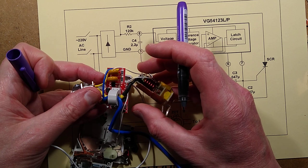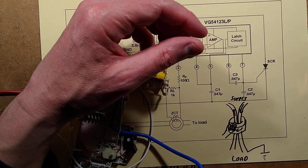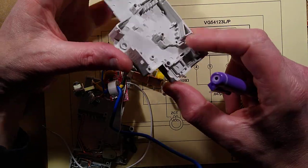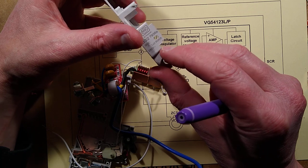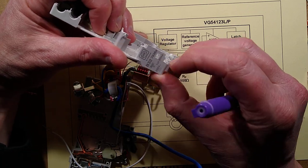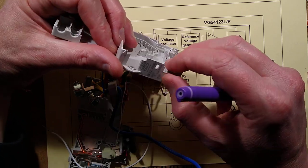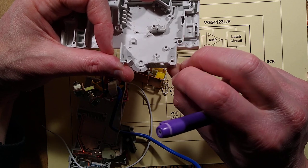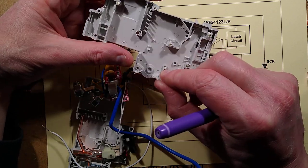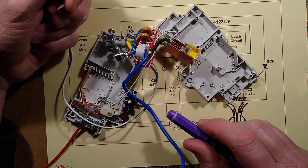But interesting little device. Oh, the reason it failed in the first place, the reason the button jammed in, is because the plastic surround where that button poked out has a very obvious rag on the edge there. I guess they just didn't clean that rag off at the factory, or maybe the mould was just leaving a bit of flash on the edge. And that's what's ultimately caused that button to jam and basically rendered this whole thing void. But there we go. Interesting.